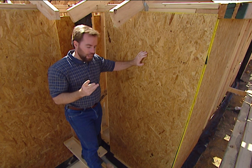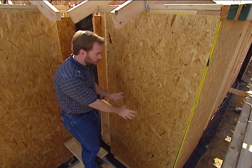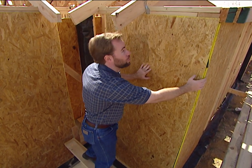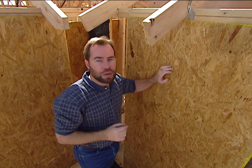If you'll do these three items — put in your bolts on your foundation (or straps if you have a different type of foundation), put a 4x8 sheet of wood on all of your corners on both sides, and use rafter clips at the top — it's going to help protect you, your family, and your valuables the next time you're in a bad storm.